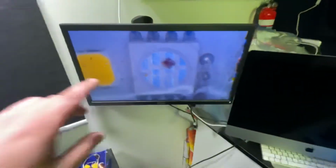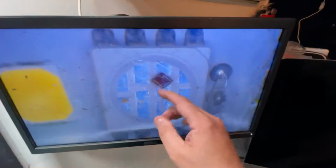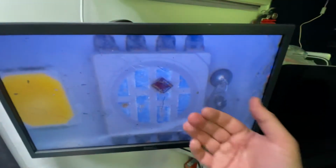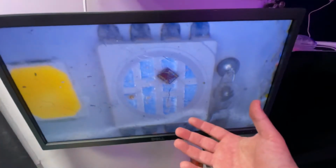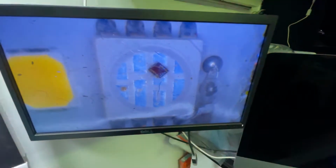You see, this chip is not very big. It's sitting right on top of the LED, which is a heat source. These are very thin wires. I reckon when it heats up, cools down, heats up, cools down, because metal expands and contracts, it's slowly working its way through breaking the connection. And once that's gone, the whole strip's garbage, basically, unless you're like me and you're willing to fix it. Most people are not going to do that.